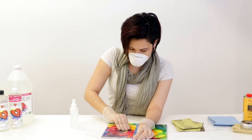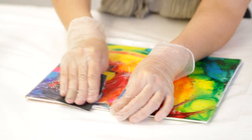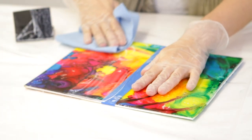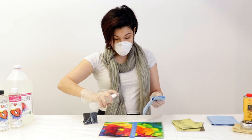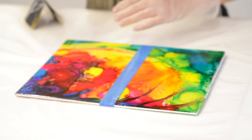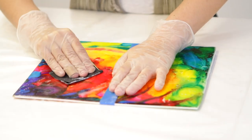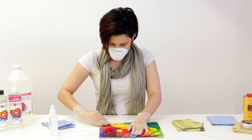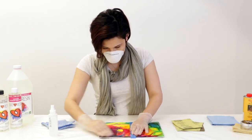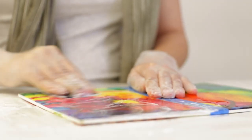So you're trying to work it up to a gritty paste. We're finally starting to see the paste — it looks a bit like toothpaste. Once that paste gets too dry, wet it thoroughly and wipe it off with your cloth. Don't be afraid to really saturate it; you do want to work really wet for this. Then start the process again by wetting your piece, wetting your sandpaper, and sanding again. I'm sanding with 320 still until I see the scratches are absolutely even across the entire piece — you're basically trying to get it as even as you can with each level of grit.